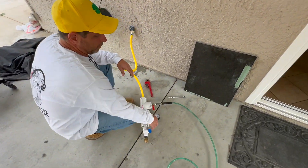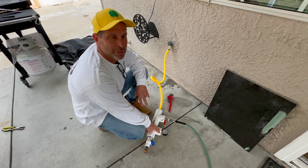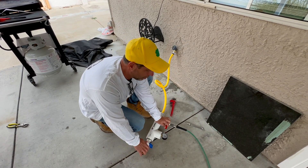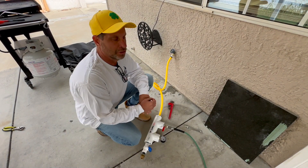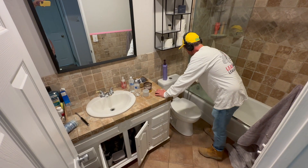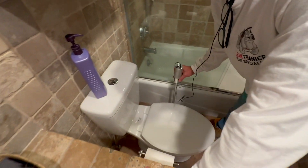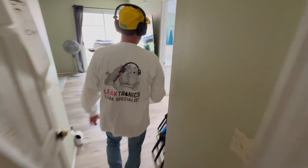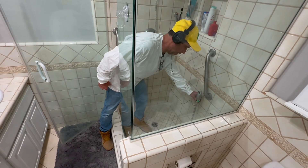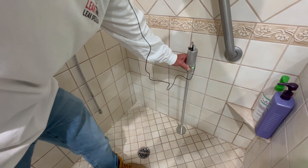This is a two-man process. The person running the compressor can't let that pressure get too high — we're dealing with threaded fittings, not plugs, but always use safety with the pressure rig. We give quick bursts of air. While he's doing that, I'm over there listening. He's hitting it with quick bursts and this is what we're actually hearing — the boil. It's loud here, not as loud over there, so we back up and listen on the other side. Behind that toilet is the shower floor — and it's screaming right here. This is the sound of that actual boil. We marked it out.